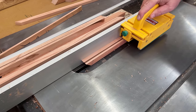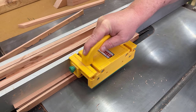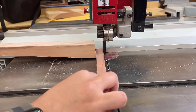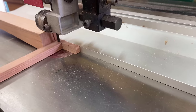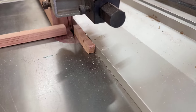Since I'm going to put a gap between the two by twos, I don't want to look at the top of the table between them and see the dado in that top board. So I'm going to cut these little pieces to fill the dado. At first I thought it was going to be kind of a tedious job to cut these, but it's really pretty quick.